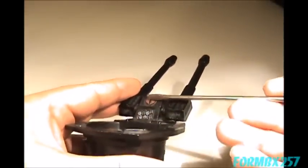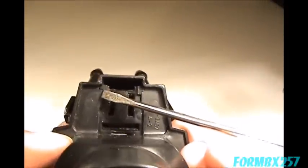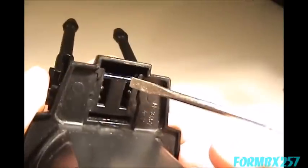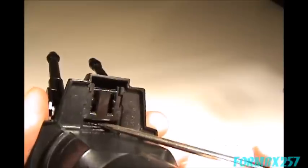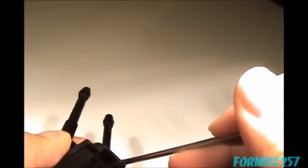The cannon itself comes in three parts. The bottom portion of the cannon housing cap looks like it's part of the entire cap, but it's actually its own separate piece, which is connected underneath by this plate. The plate itself is what you're actually going to try and get loose. It has these tabs on the top which are very fragile, but you have to pull them down and towards yourself so that the entire thing can be pulled backwards and that portion of the housing cap comes out with it.